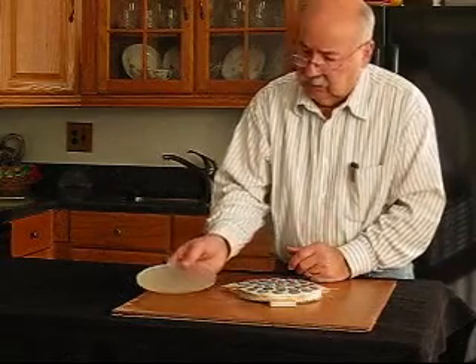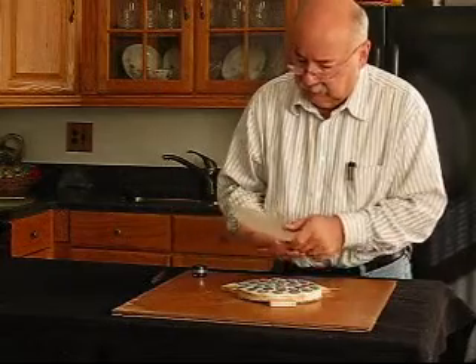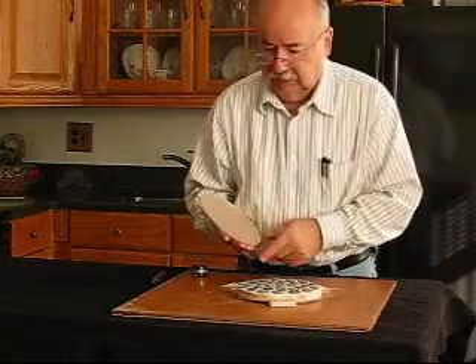Change your bubble wrap, hose down your board, and get everything cleaned up, because you don't want any speck of coarse grit laying around — if you accidentally pick it up you can waste a lot of time. I'm ready to go on except I've got probably another five or ten minutes of grinding on 140 micron before going to the next stage.